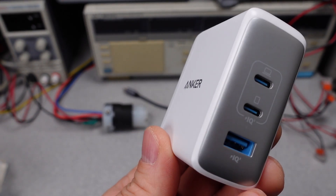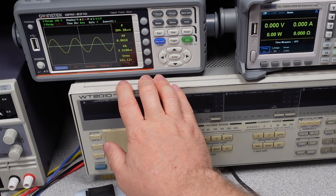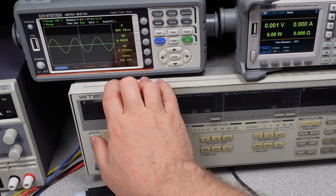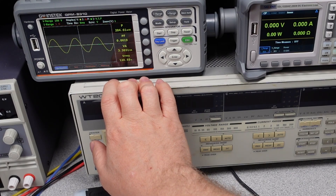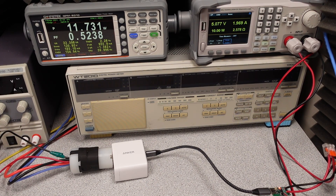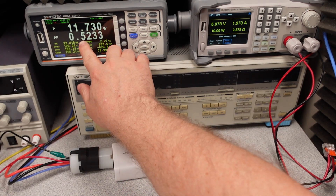This is an inconvenience, but in general you shouldn't be overloading the device unless something goes quite wrong. In the idle state, I am seeing very large peak currents. When I look at the graph, we can see these occasional very large peaks of current. This device is very unstable in the way it is connecting to the AC grid. This makes me worry about how it performs for radio frequency emissions with these short, fast pulses being shoved down the AC wires, which act like antennas. This is the first device I have seen with this amount of large spikes on the AC current line.